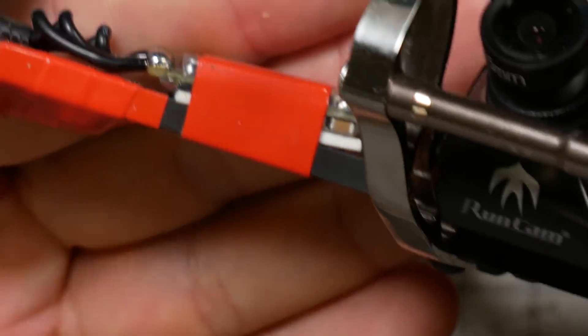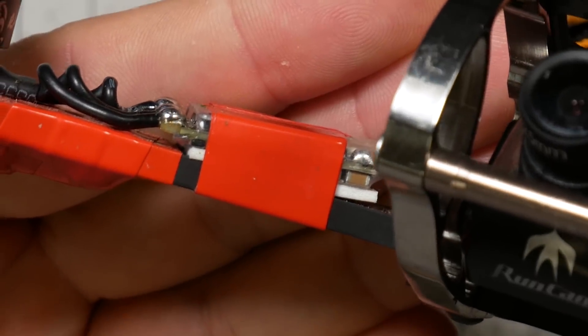This is not about vibration resistance — it's about shock absorption. When the ESC is right up against the arm, there's some risk of a short to the arm, and also constantly taking hits to the arm can knock components off the ESC. Adding just a little bit of insulation there can help protect the ESC. It also keeps the ESC from sliding around. Providing padding is the primary use for this tape.